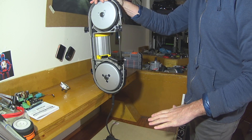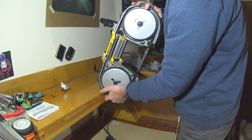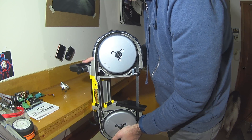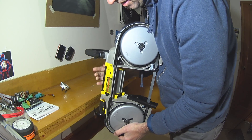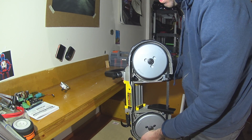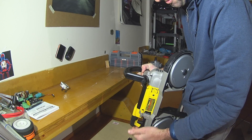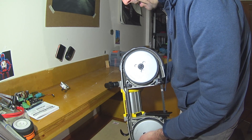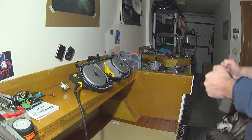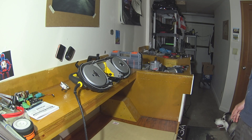It's got a cutting plate on here and I think that needs to be flush with this bench. I think we need like a boss here which has sliding holes in it so we can fine-adjust this and get it perfectly straight, and then maybe have something come up from the bottom that supports here. That will get the thing solid and really nice. We can use a quick release screw, maybe a quick release something down here so we can pull it out and plug it back in quite easily.